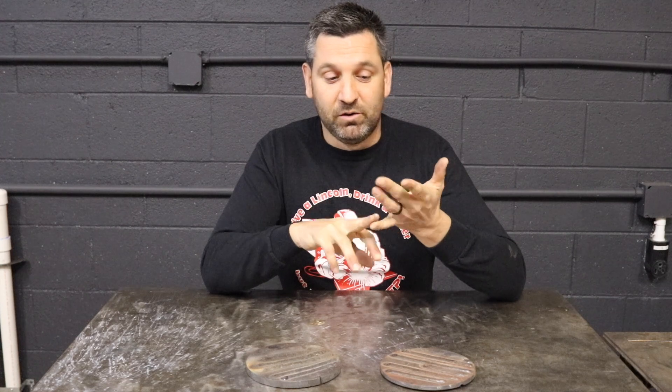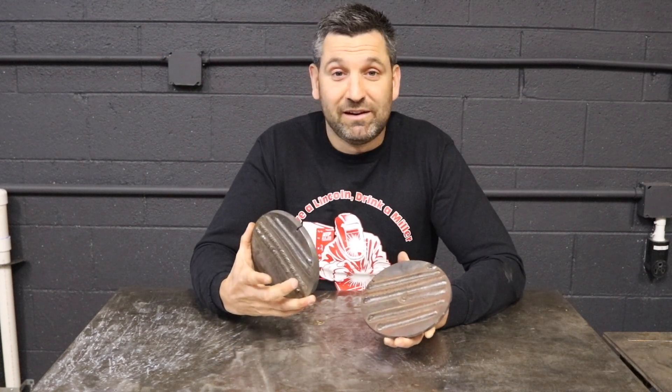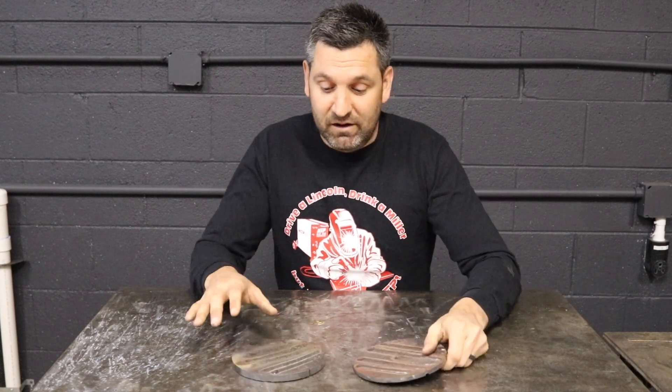Ultimately, take this machine in your garage — it's small, it doesn't take up a lot of space. Take it out in the construction world, in a fab shop, whatever — you can stick and TIG weld with it. Absolutely super impressed with this machine. This is a must-have when you're talking about constant current processes for stick and TIG. You can do scratch start on pipe, socket welds, whatever it might be — just overall solid. 6010 whip-pause, there's no stopping it. You can run it as a stringer or whip-pause, and the arc is not going to go out like some less expensive knockoff brands. You can even run stick on pulse, which is pretty neat.